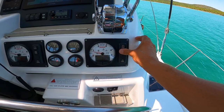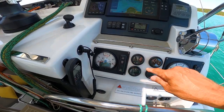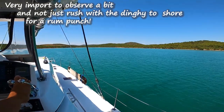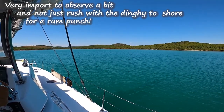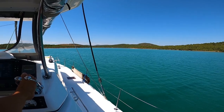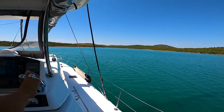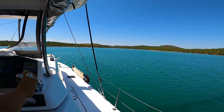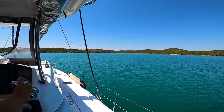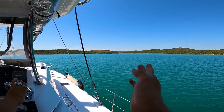Now a very important step is to sit back, relax, and observe. How does the boat swing? How is the boat swinging relative to other boats? Remember, we now have 73 meters of chain out. Other boats might have a lesser scope and might swing differently than us — if we have a 1:12 ratio and they have 1:5, they will swing differently. So it's very important if there are other people here to ask them what length of chain they have out and whether they're happy for us to anchor next to them.